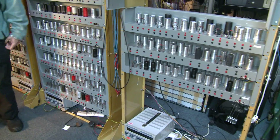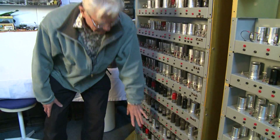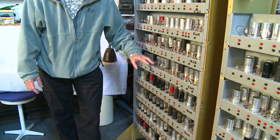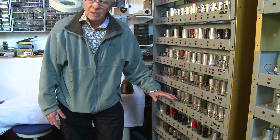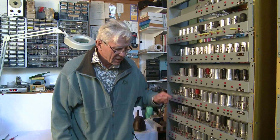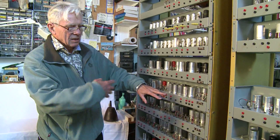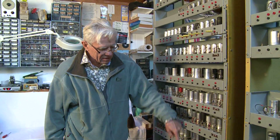The only function this performs is addition and shifting. Shifting doesn't happen all the time, but the adder is adding every time the data goes around — the adder is adding in zero. So it will keep going forever with the same value unless we inject another value, which comes in here, and this particular unit collects information from lots of different places and adds it into that loop.